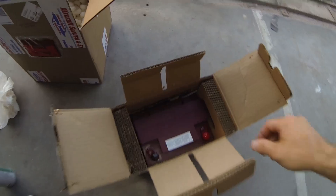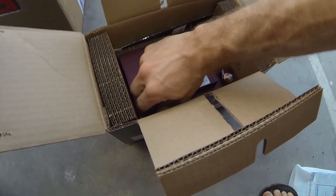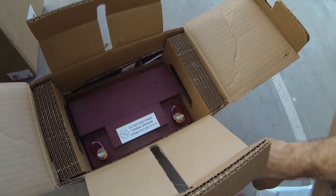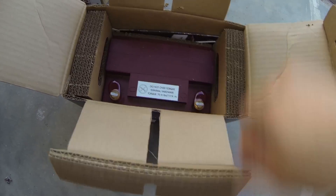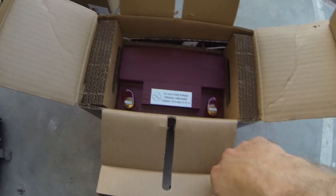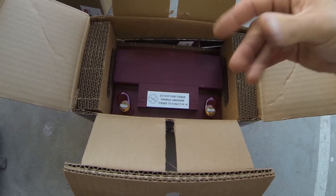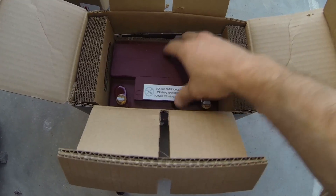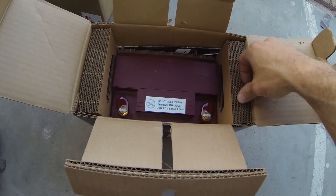So we're going to go ahead and get our new battery. Before we install it, we want to take a good look at it. We'll remove these handy little covers they put on our terminals and get a voltmeter to check that it is in fact charged up and ready to go. Otherwise, we'd want to throw it on a charger. They say they ship these things all charged up and ready to go, but who really knows. Note that the connections are slightly different on this Concord than on the Gill. If you're replacing a Gill battery with another Gill — a six-cell battery with electrolyte — there's actually a bit more of a procedure: fill up the electrolyte to a certain level, charge the battery some, fill it up a little more, charge it again, then load test it. With the Concord battery, we're supposed to be able to just pull it out of the box and throw it in the airplane, but just to be safe we're going to check the voltage and put it on the charger a little bit to make sure it's fully charged.